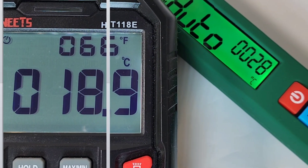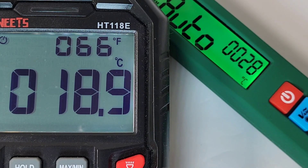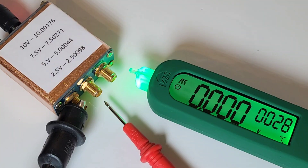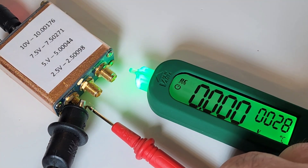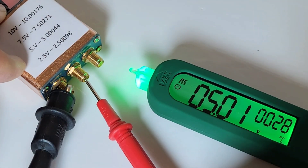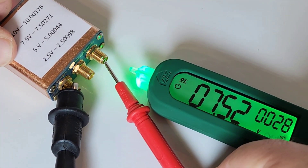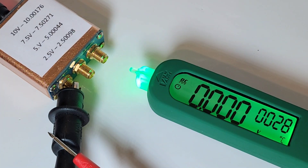Just to give you a look at the temperature — this is much more within reason: about 19 degrees Celsius here in the lab, 66 Fahrenheit. Definitely not 28 degrees Celsius. The Fluke agrees: 19.2 degrees Celsius. So yeah, that initial reading was way on the high side. Now a little voltage test using a DC reference: we want to see 2.500 and we're coming in at 2.509. Next we want 5.00, coming in at 5.01. Then 10.00, coming in at 10.03 — only three counts out, looking good. And finally, 7.50 coming in at 7.52. Accuracy-wise, it seems to be doing just fine.